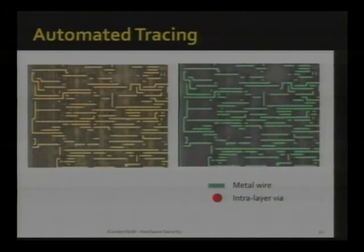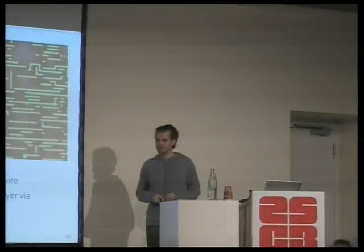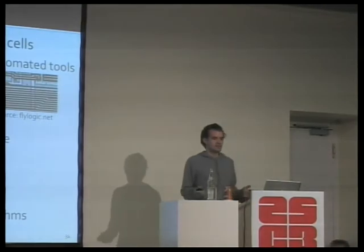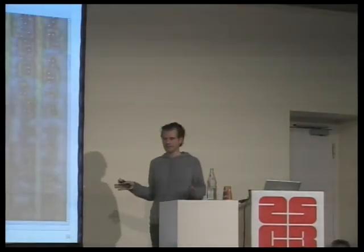So we have a map of where everything is on the chip, and we know what is connected to what, which gives us a circuit plan, right? And the circuit plan is basically equivalent to source code. It's very messy source code because it was never meant to be read back, but it's nice enough for us to understand the functionality behind it. Is that clear so far? That we can find the circuit just from a polishing setup, a simple microscope, and a few open source programs?